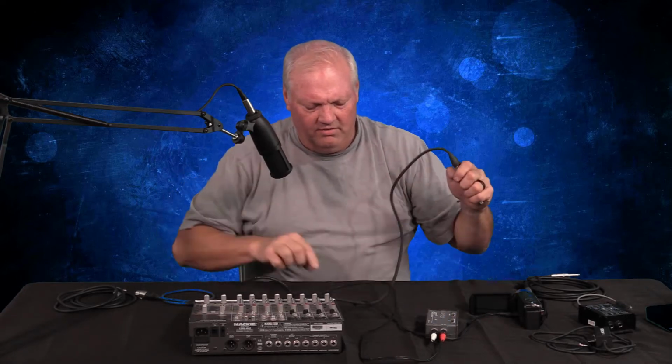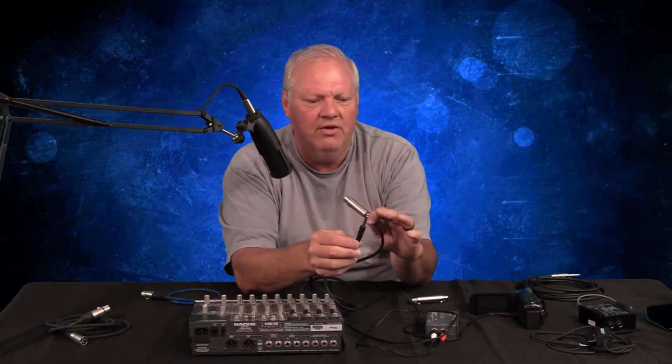So occasionally we'll get somebody say, well, the little mixer that we bought that we're using here in our location doesn't have the 3-pin balanced line output. And that's okay too, because most of these things have a 1/4-inch tip ring sleeve balanced line output. So you can get an adapter cable. In this case, you can get an adapter cable that's got your tip ring sleeve, which is your balanced line, and it's going to a female XLR type connector or 3-pin professional audio.